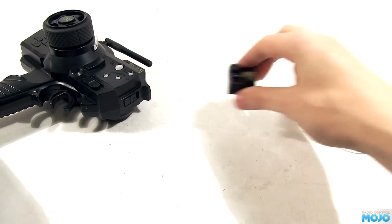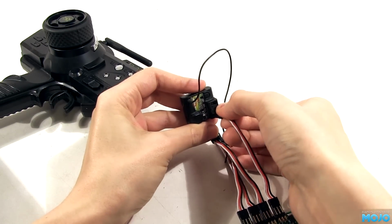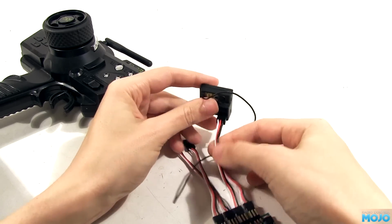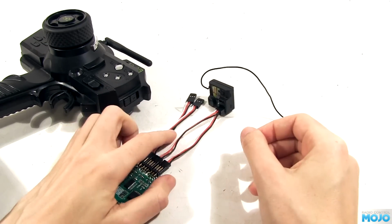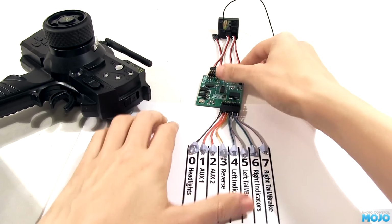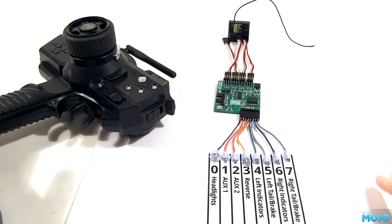To show what the controller does with just 2 channels, I'm going to connect steering to input 1 and the throttle to input 2. Nothing else. We're going to need some LEDs to see what's going on, so here's my super fancy test rig, featuring tombstoned 0805 resistors and some blue tack. Only 1 LED per channel here, but the board will drive many. More on that later though.